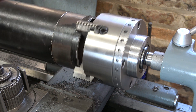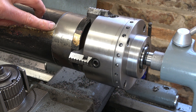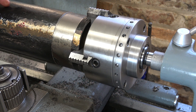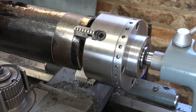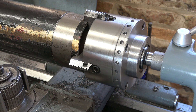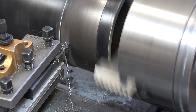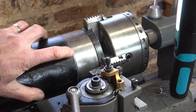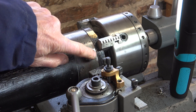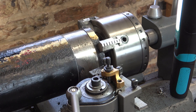Good morning. When I'm machining this, it seems I have more rubbing than cutting. I watched a YouTube on machining cast iron and learnt that if the cast iron is allowed to cool too quickly and is chilled, the surface can get extremely hard and difficult to machine. It may be that my carbide has got a bit dull, but I will try with a bit of high-speed steel. It's a good cut — you can see the greyness in the surface, which means it's cutting into it nicely. Look how polished that is where I was using the carbide, where this high-speed steel tool hasn't touched it yet. Quite a difference.